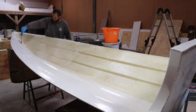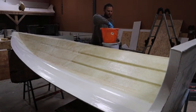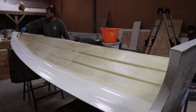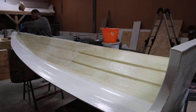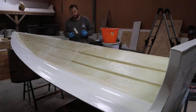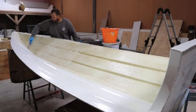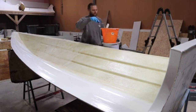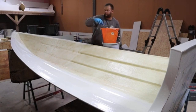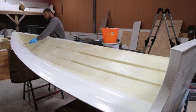From my point of view, the boat is usually built in polyester, so why would you not repair it in polyester? If it is a very old boat and the fiberglass is very old, and you've bought a project boat in the back of a marina and you're a bit worried that there's holes in the bottom of it, and you just want to make sure that that ain't ever coming off again, that no water's ever going to get in there and you're never going to have to touch it, then yes, fair enough to do epoxy. But if you ever went to do anything on top of that, you can only repair it in epoxy, because the polyester will not chemically adhere to what you've done.